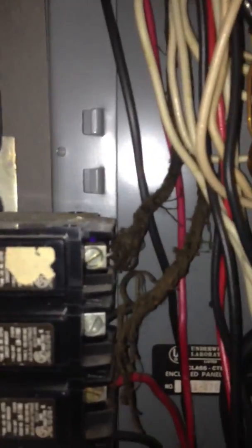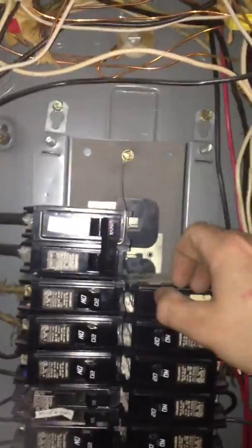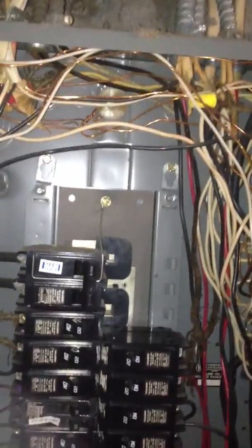We're going to put it on here that there's a 20 amp circuit here, which actually is incorrectly fused because it's on an old ratty 15 amp wire. We're going to take that out and add a twin in the spot. This panel is basically overloaded and it should be updated. We will bring that to the homeowner's attention.